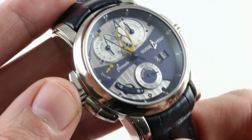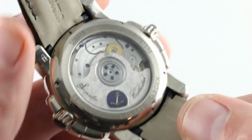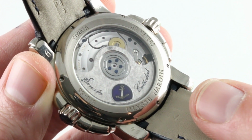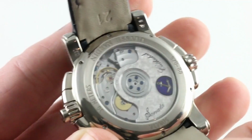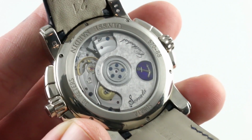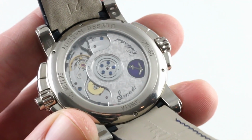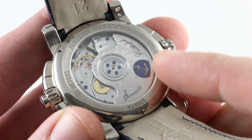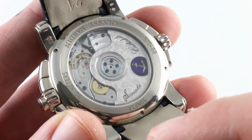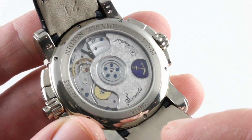Okay, now let's talk a little bit about the watch inside. This is the UN Caliber 67. Remarkably sophisticated. It pivots on 109 jewels. This is a high horology engine of the highest degree. It features a wonderful rusticated 22 karat white gold winding rotor with a beautiful lacquered Ulysse Nardin inset anchor. Ceramic rotor bearings at center. It is a bidirectional winding movement.